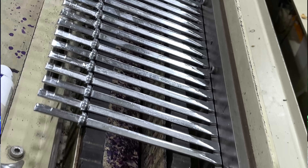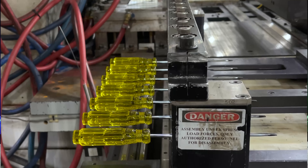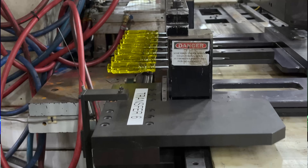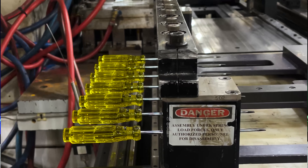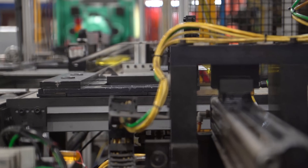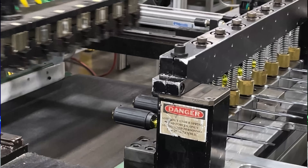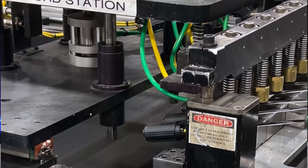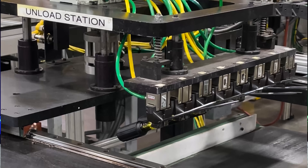The next step is it goes to a machine that takes a whole bunch of different shafts, puts them all together in an assembly line fashion, and then moves them down the line into a machine where a handle is hot pressed onto the tool. Every single one of these gets a handle added to it, and there's no inscription or anything in the top of the handles yet — it just comes out with handles on it. There are different processes for different sized handles; one machine might do larger handles, one smaller, and one might do insulated handles.